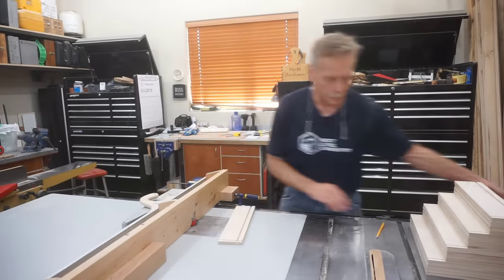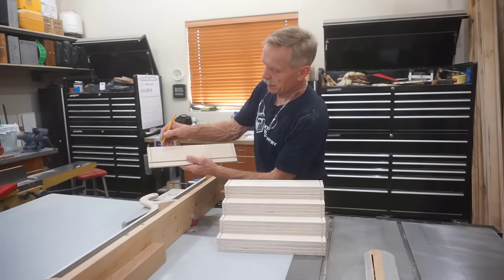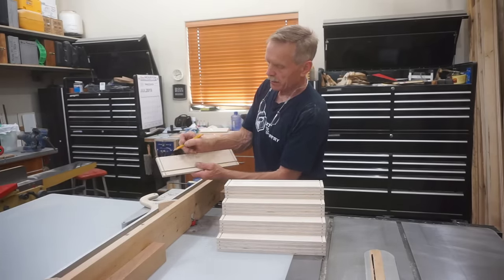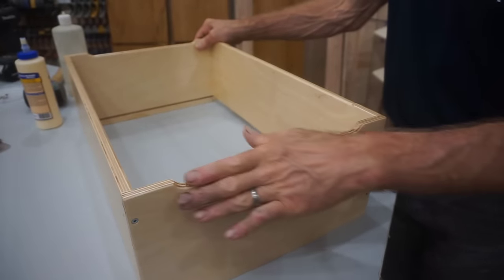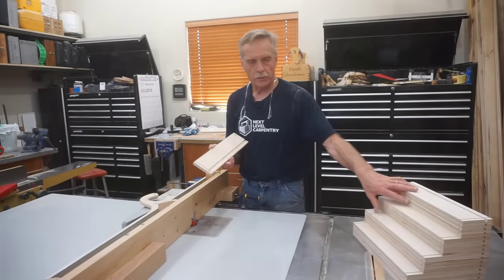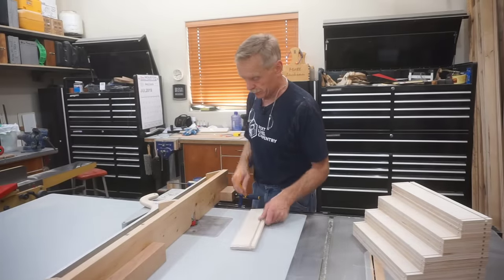The way this is set up is to put a 3/8 notch, I'll call it, along the top end of each piece, and it starts and stops 2 inches in from the ends. I've got the pattern piece that I'm going to run this on first before I do the top edge of all the sides. The front and back stay the way they are.